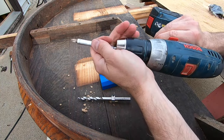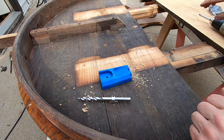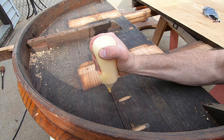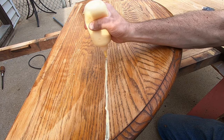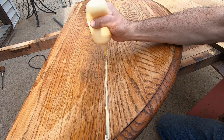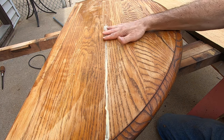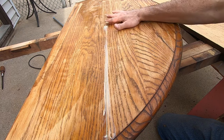I'll use this same technique four times, spaced evenly along the crack. Now I'm squirting glue forcibly into the crack on both sides. Let gravity work in order for the glue to penetrate completely. If the split is very narrow, you can sometimes water down the glue a bit. Sometimes I'll even use compressed air to force the glue deep into the joint.